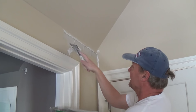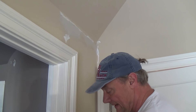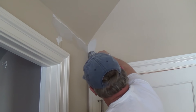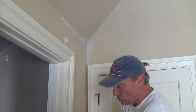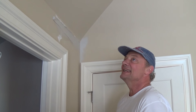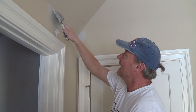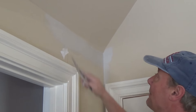If you look really closely, you can see the lines on this straight flex — I actually know what kind it is. I've used straight flex for a lot of years and didn't have any problems with it until one year. I was putting straight flex in all my homes and we had a really humid year — big temperature and moisture fluctuations. In every single house, because I guarantee my work for a year, every single house that year I had to pull out all the straight flex and replace it, because every single house that was loaded with straight flex popped and cracked on me. It was a very, very costly year.